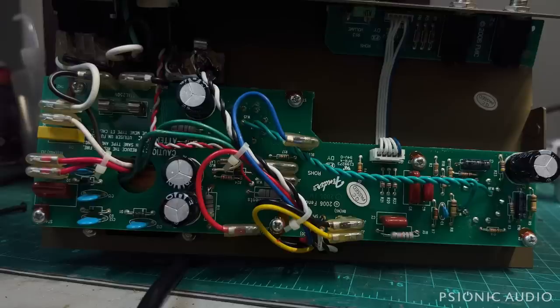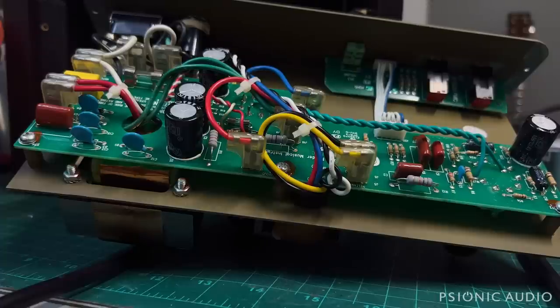Fender would not do what I'm doing if this came in under warranty — Fender would just swap that board. That's how it was built. If it's out of warranty, buy another one. This brings us to the tech's dilemma, both from a position of ethics looking out for the owner and self-preservation in a business sense. This amp seems visibly okay, there's nothing obviously wrong, and all the resistors measure okay. At this point I would wager a bet that it is either one of the four filter caps or one of the transformers.